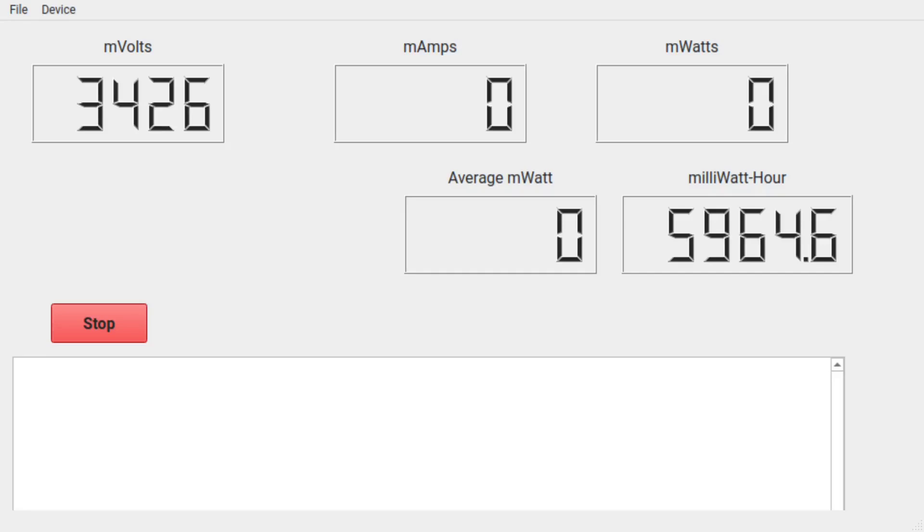Only more testing will tell. As you can see, total power delivered was very close to 6 watt hours for this first run of the battery. This discharge run was charged without my measurement device attached, since measuring the charge current will decrease the total charge the battery receives. Looking at the discharge of the battery in the old controller — with this discharge run being charged while measuring — I got about 5.8 watt hours, a bit less than 200 milliwatt hours of difference. This did answer my question about the rating on Sony's battery: I suspected Sony would use the charge cutoff and discharge cutoff of the controller to rate the usable power of the battery, and they did. Good on them for that.